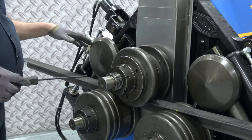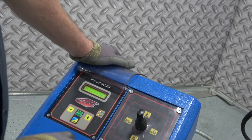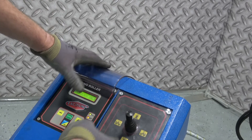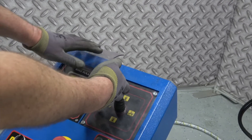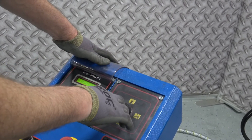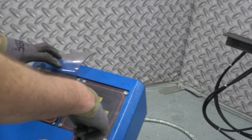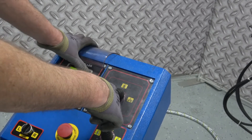Up there it goes to programming, and we stage right and left. After you've programmed the controller and the values are input and saved, we're going to find the top surface of the work. We'll manually run the machine — I choose up and take the machine up by depressing the pedal. Then I come down and touch the top of the work with the tooling. I release the pedal, hold down, hit enter — that stores top of work, all zeros in the right column.